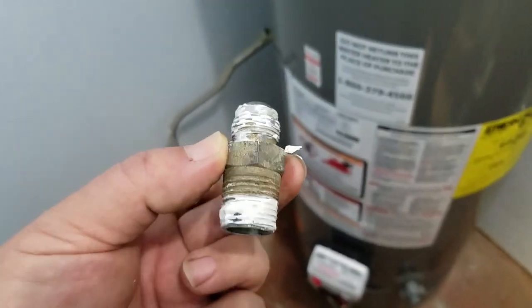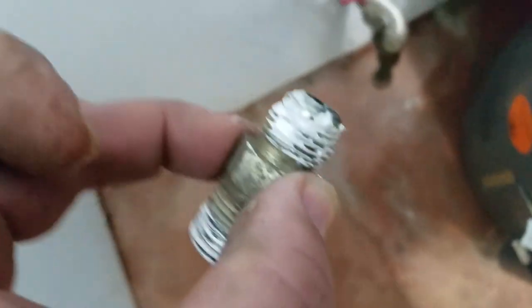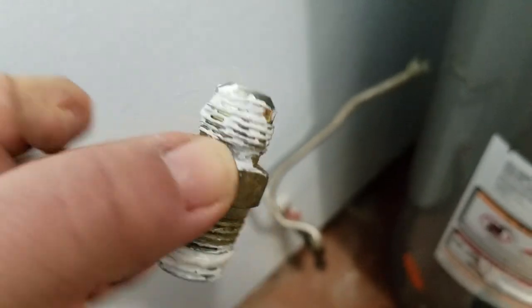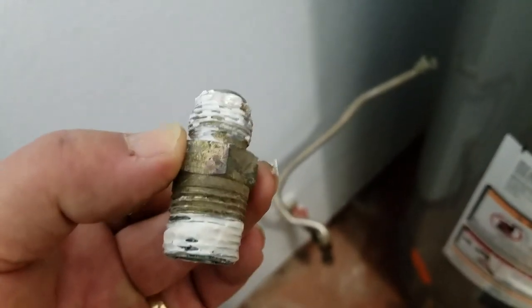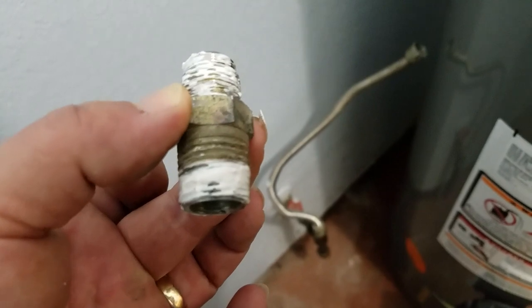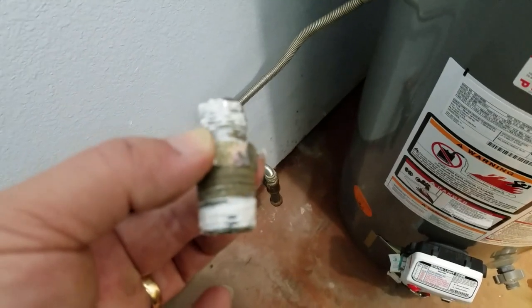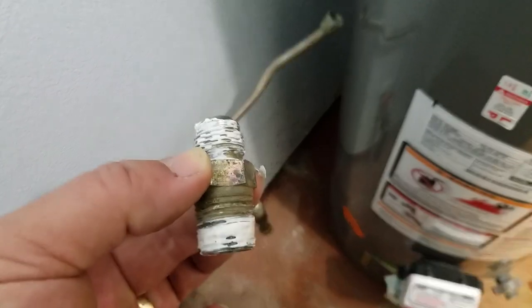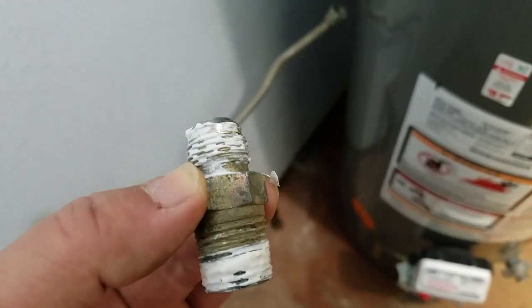So I have this fitting doped up, and the front side here is pretty important because you're going to put it in here. This is a ferrule end so we don't really need to put dope on it, but I'm going to do it anyway. We're going to get this in there hooked up, apply some propane to let the pressure build up, then get the Windex out and check for bubbly bubbles. If it's bubbling, it's leaking — we don't want that. Stand by.